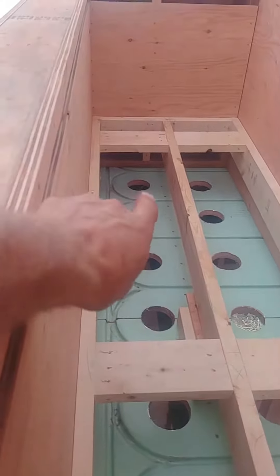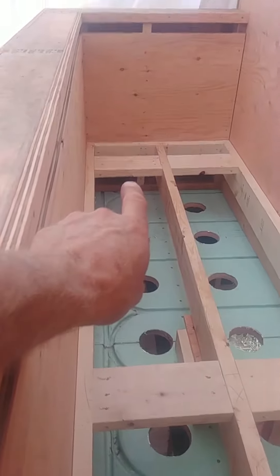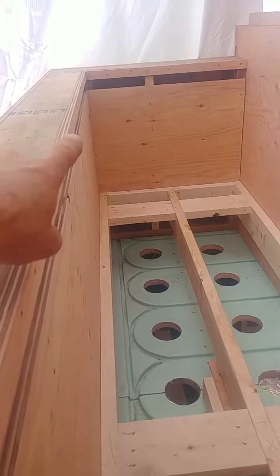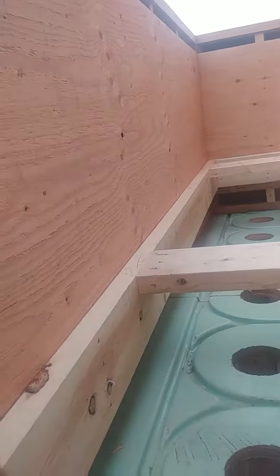On this side, as you can see, just in between the joists there's a strip cut from the plywood, so this whole area is all vented out here. It'll go through and up through these vents on the far side, which is the west side of the building. And I've also got some vent cutouts here as well, because it vents underneath here as well, through the bottom of the 2x4, up the plate, into the wall. So no problem with ventilation at all.